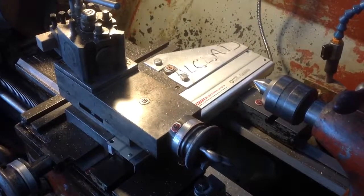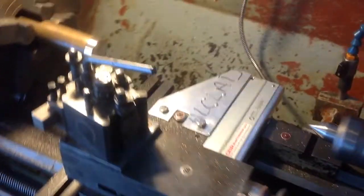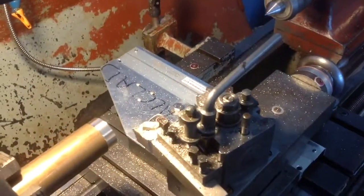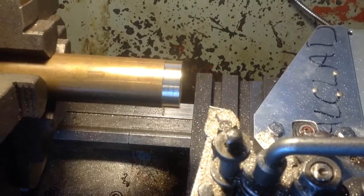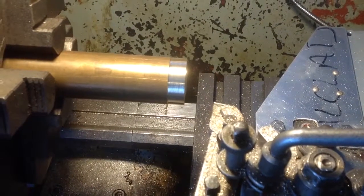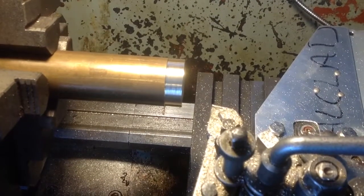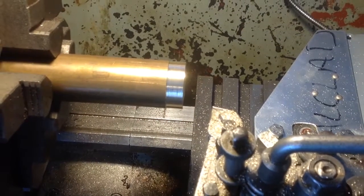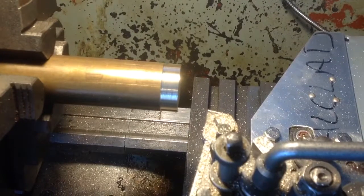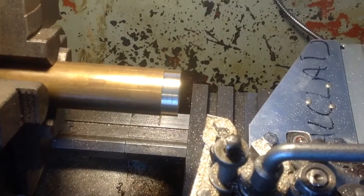I finished the installation for the X-axis and I'm not too unhappy with the way it looks. What we all want to know is: is it accurate? I've got a piece of brass. I've taken two or three cuts so I've got no tool spring — that's kind of the size of this, it's not cutting any more. Two or three cuts at the same setting, that's where the tool tip is, representing the diameter of the brass. We'll try setting up turning to some different diameters and see how close we get.